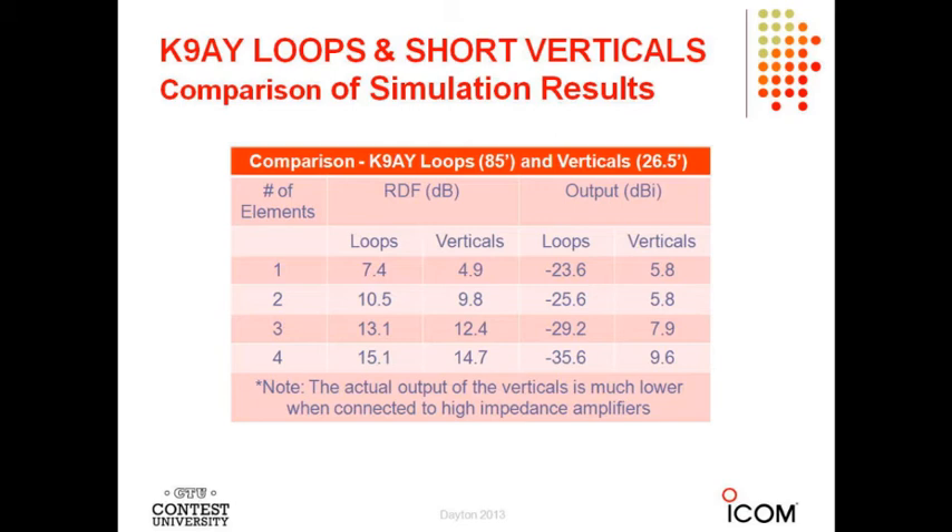The two- and three-element spacings are 80 feet apart and the four-element is 100 feet apart. It's been in operation through this year's good season, from late fall through now. I was surprised — I can truly hear the difference in 0.6 dB signal-to-noise ratio. Except for two times, when I could hear VK3ZL better on the vertical array, and in both cases I could hear best on the transmitting inverted-L — probably the horizontal component was helping.